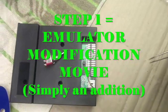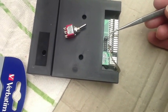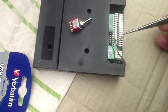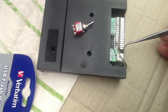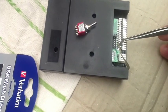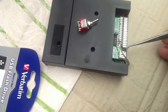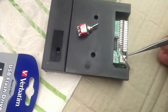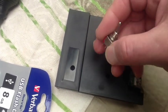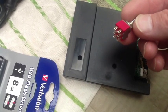The aim of our project is to make and break a connection at the second pin from that direction. Those two pins need to have their circuit broken and joined. Also simultaneously, the connection between pin number 6 on the plug — which is the third pin on the top — and the ground plug, which I've soldered underneath. That's the aim: to make and break those circuits separately, using a momentary switch. When you pull it down it springs back, and it's dual pole so we can make and break two circuits simultaneously.